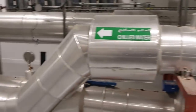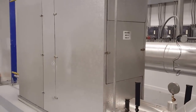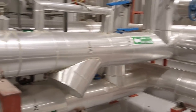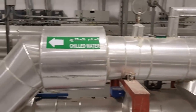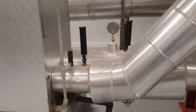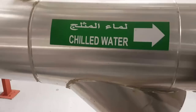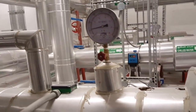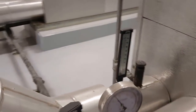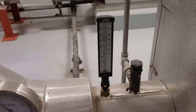This is the supply line going to the heat exchanger, which is covered with cladding. The chilled water is coming here through a strainer, supported by a support bracket, and this pipe goes directly to the heat exchanger. There are four heat exchangers. There is a strainer, a pressure gauge installed here, and after that the chilled water goes to the heat exchanger — this is a full water heat exchanger — with a temperature gauge and a PRV.